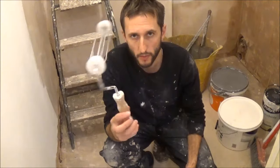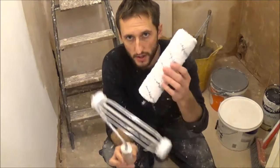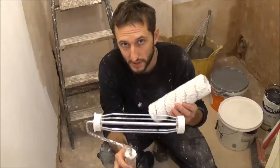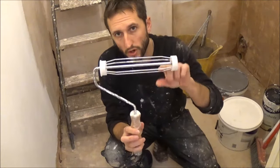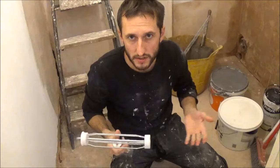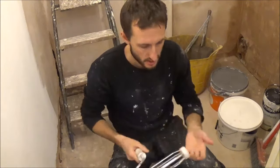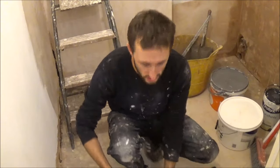It's important to remember when buying rollers and heads that they come in different sizes, so make sure your head fits the roller. Some are sold in metric sizes and some in imperial, so just bear that in mind. These also come with long extensions — you can see there's a thread in the bottom so you can add an extension pole, which is useful for ceilings. Some are telescopic so you can use them at a short or long length, whatever suits your needs.